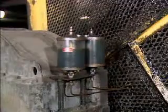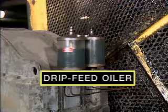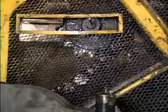We've seen how to select the right lubricant for the job and a couple of ways to dispense oil from large drums. Now we'll discuss some oil lubricating devices: a drip feed oiler, some oil baths, and a ring oiler. A drip feed oiler is an automatic lubricating device used in industry for many different applications. In this example, drip feed oilers are being used to lubricate a chain drive — there are two oilers, one for each side of the chain, with glass reservoirs holding the oil supplies.